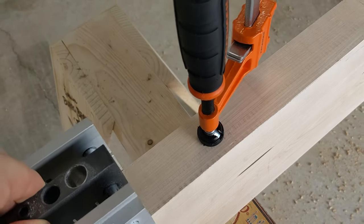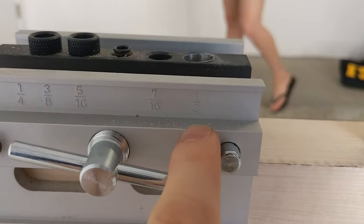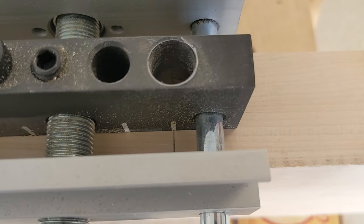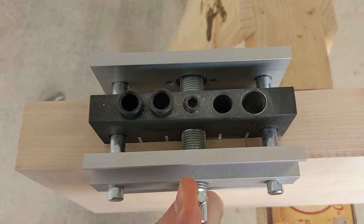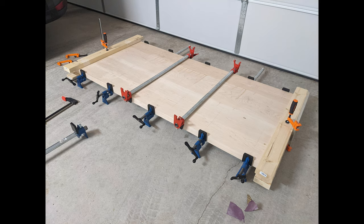All we've been doing is clamping the wood down in an opposing fashion. We were finding it was tipping if we put both clamps on the same side. With the doweling jig, we select the one-half measurement — there's a little line for the middle of the hole — and we just try to line it up. Both silver sides come in at the same time. We're near the limit of thickness this jig will take, but it seems to be working really well. After that, we stuck our half-inch dowels in the half-inch holes. They were kind of loose, so we put in a bunch of Titebond III glue, clamped everything together, and left it overnight.